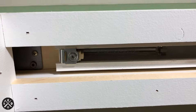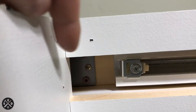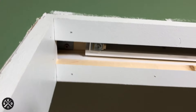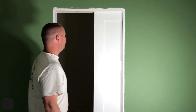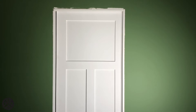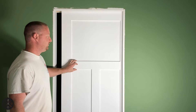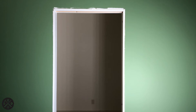The last thing you want to do is put your stopper up there for the soft close, and then measure two and a quarter inches from the finished jamb. Let me show you what it does — to close it, watch the soft close in action. Works awesome, just nice and gentle. And same for the soft open — it just slows it right down and stops it.